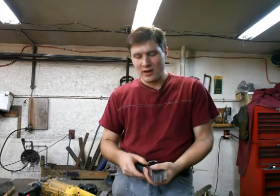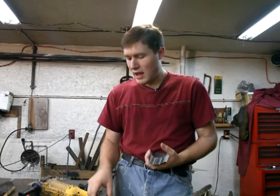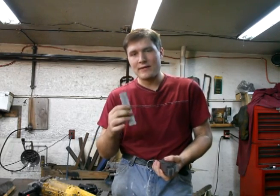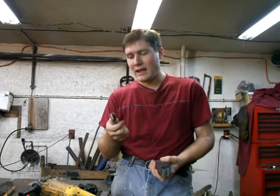I live here in Mountain View, Missouri, and I'm going to show you how I'm going to make my Mastersmith performance knife. To do this, I'm going to start with 1080 and 15N20, 20 layers of each, and I'm going to alternate it, 1080, 15N20, 1080, 15N20, and so on until I have the whole billet stacked up. But first, I need to grind all the scale off of the 1080 because it'll inhibit the two materials from sticking together.